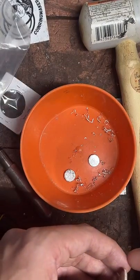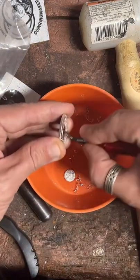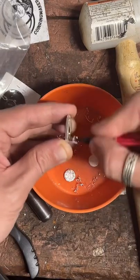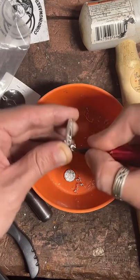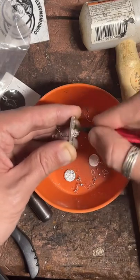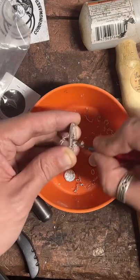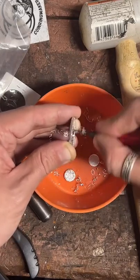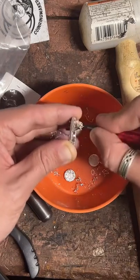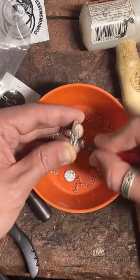Did you do me coin molds if I sent you a picture of 2 sides? No, it takes a ton of pressure to make a coin, so I don't actually make coins. You need like a 200-ton press or something. The biggest one I have is 12-ton. It's just not enough. Minimum 50-ton to make a coin. There are people that do it. I'm sure if you Googled around, you could find someone to make a custom coin for you, but I make coins into rings. I don't make coins.